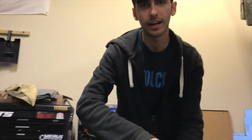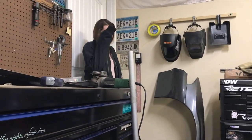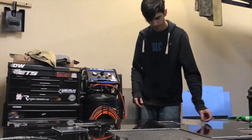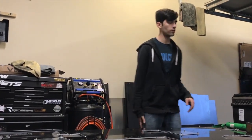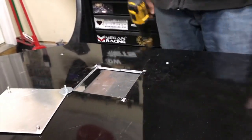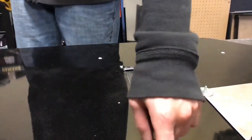The block-off plates are done — ended up going a little differently than I originally intended but still does the same job. They pivot and rotate wherever you want them to rotate. I want them to do that so I don't lose the panel or it falls off. Now I'm just going to pull off all the burrs, make sure it sits as flush as I can to the inside. Then I just have one step left — sealing up all the edges.